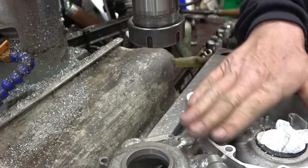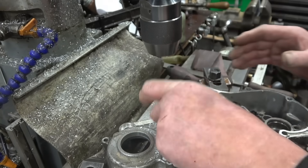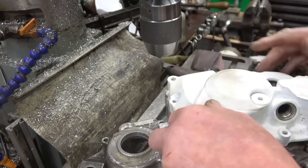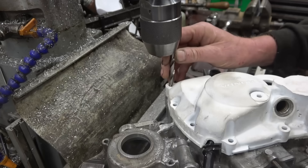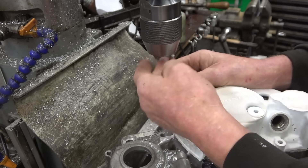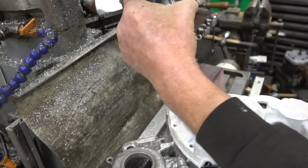That's pretty good - certainly settled for that. That's machined up quite nicely. I've machined that face flat. I need the bracket that goes on here to get the height of that and pick the hole centre up. Now we need to drill and tap this. I have got the casing that's going to go on to it, and with the casing held on there are two dowels - that's the hole there. Now I'm going to put a helicoil insert in, and that is the helicoil drill, which is a really good fit in the hole. I know it needs to be 25mm deep because I measured it before I started to hack the casing apart.